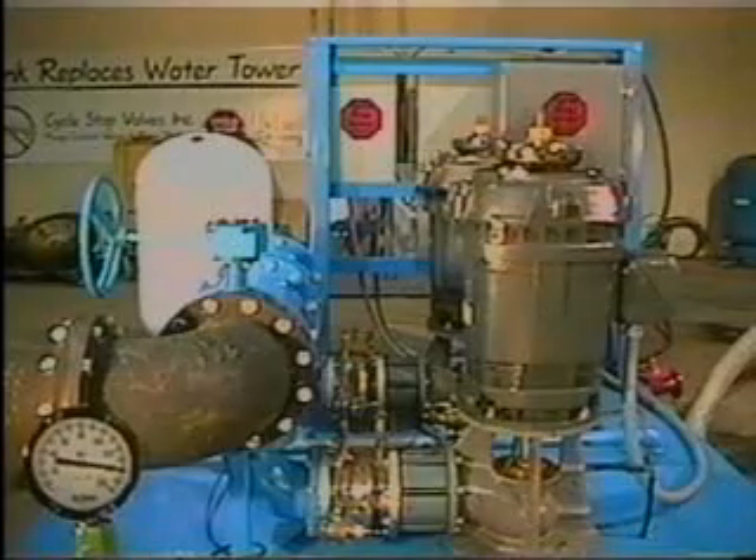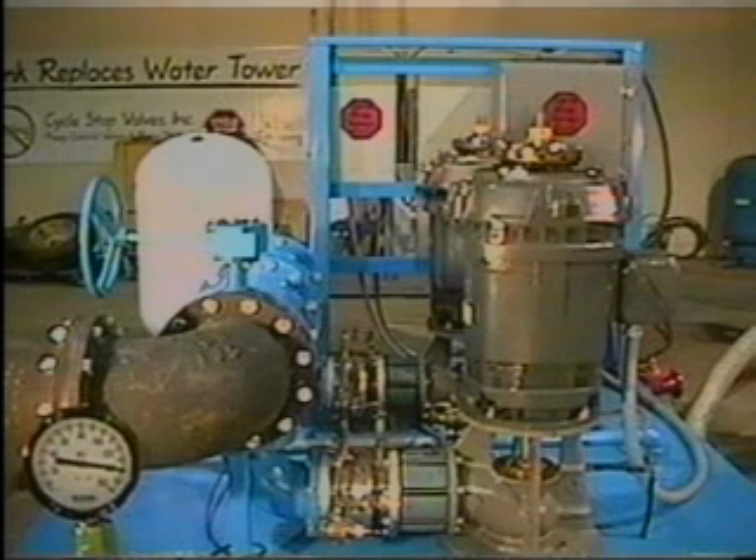The 5-horsepower uses from 5 to 9 amps, and the 75-horsepower pumps take from 58 to 90 amps of current each. As flow increased from 0 to 1,550 GPM, current draw from the three-pump station increased from 0 to 189 amps. As flow is decreased, electric consumption decreased in proportion. Multiple pumps working together are always more efficient than a single pump trying to do multiple jobs.